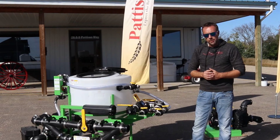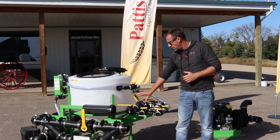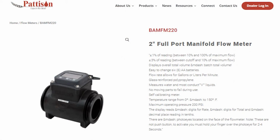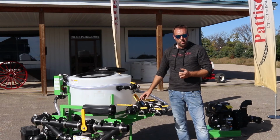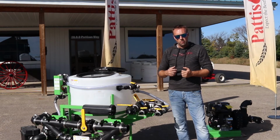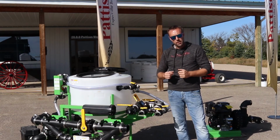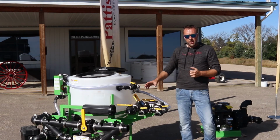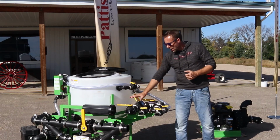So on the side of the FLEX, what we've got again is the 2 meter setup. We have 2-inch plumbing coming straight in on the mag meter. The Banjo Mag Meter uses, there's just 4 little posts inside this meter. There's no other restrictions, so product will pull through there quite quickly. With some of the thicker, more highly viscous chemicals, they would slow down with any kind of impediments inside. But through this 2-inch Banjo meter, again, you're going to see 220 liters a minute being pulled through there. So that's on the 2-inch side.